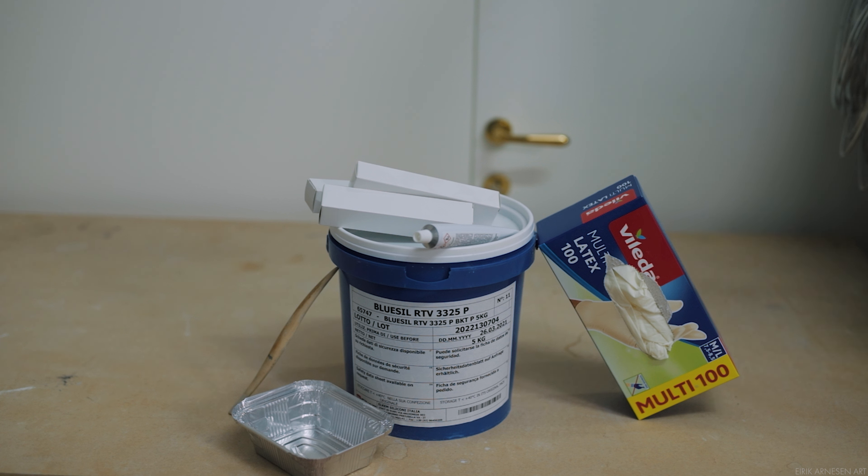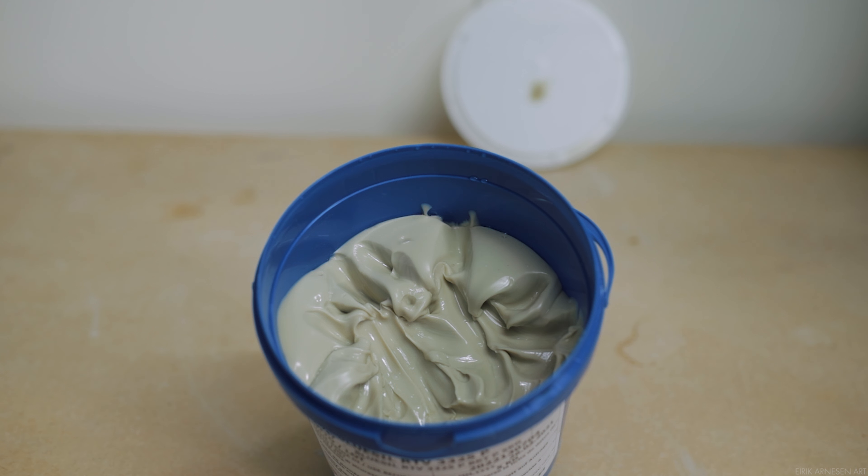They're not super dangerous but it's probably good to use gloves. In general it's only going to be the silicone that we would want to keep our hands free from. Later when we work with plaster this is not really a concern, though plaster does dry your hands out and some people find that annoying. A container for water is needed as well, as you'll see later — use a disposable one or one dedicated to this cause. Some sort of wooden clay modeling tool to manipulate silicone in tight corners, nooks and crannies where we can't fit our fingers is going to be useful as well.